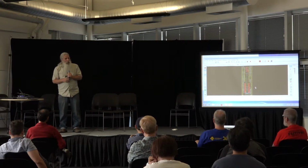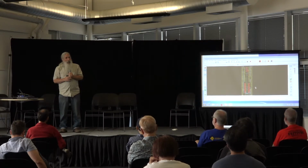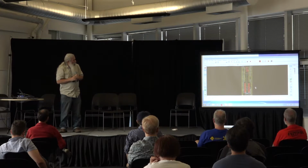You want to try to minimize the number of holes that you put through the board or from layer to layer, because you chew up your routability more than anything else. You might want to look at maybe moving stuff around more and optimizing the positions of it, or usage of your I/O pins and things of that sort. So that's about it.